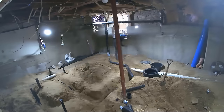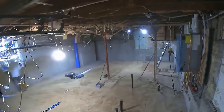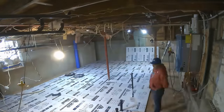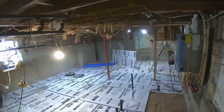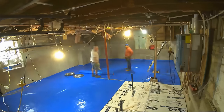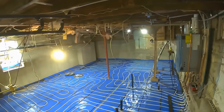They've got all the heated floor tubing tied up — you can see it poking through the floor — and they're starting to cover everything up. Our guys are back in here now, making it nice and flat, smoothing it out, getting it ready. We're also putting in insulation — something we haven't done on other jobs. This keeps the heated floor efficient: you don't want to heat your floor and have it all seep away into the ground. This insulation keeps it efficient so the homeowner isn't wasting money. Then the vapor barrier comes in — and once it's down, you can really see just how big this basement feels.